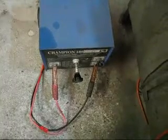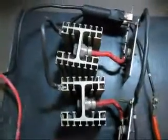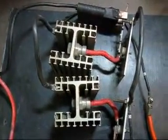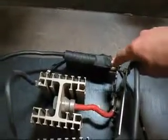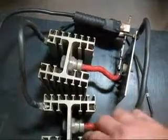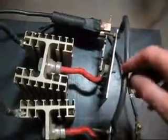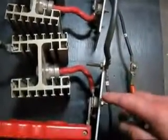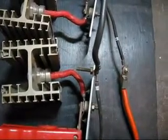Changing AC to DC. There are the two output leads from the welder — they go over to here. This is my bridge rectifier. There's one of the AC leads in, and there's the other AC lead going in. Now what I've done is I've used some diodes from my junk box. Here are two large ones — they're 300 amps each. And these two here are 50 amps, but they're four diodes in parallel, so they should give about 200 amps.